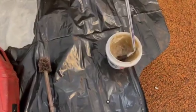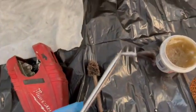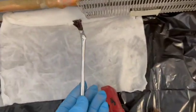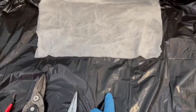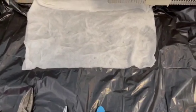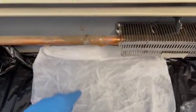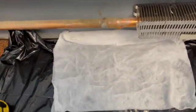I have a drill and a wire brush — I'll show you how I clean the pipe. I also have flux. What I do with the flux brushes is bend them at a 45 degree angle so I can get behind the copper pipe whenever I apply the flux. I lay a plastic drop cloth down to prevent making a bigger mess. If we cut this pipe and there's a bunch of water in it, I have dry paper towels on standby to catch any extra water that might leak.